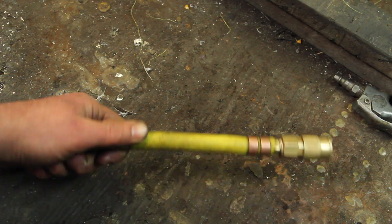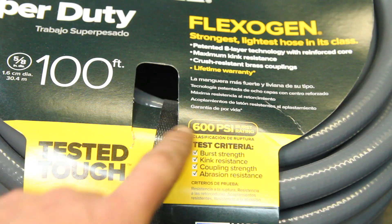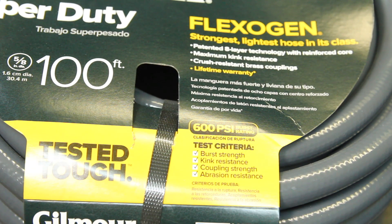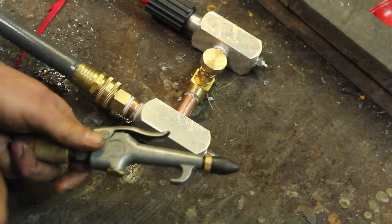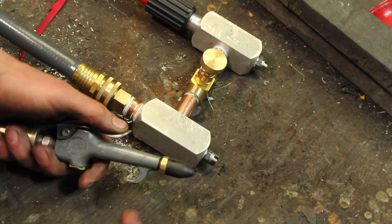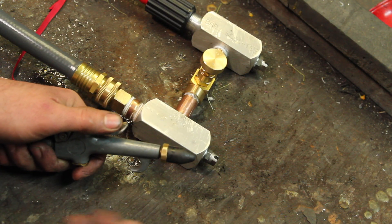If you're outside in freezing temperatures with a small air hose, that condensation will freeze pretty quickly and build up and block the airline. So use a bigger hose — this has a burst rating of 600 psi, so putting 90 psi of air through it shouldn't be a problem. When the air comes out of the hose and the pressure drops, the opposite happens. Anyone who's done that knows the air is nice and cool — you get some evaporative cooling.